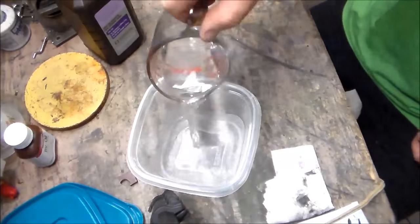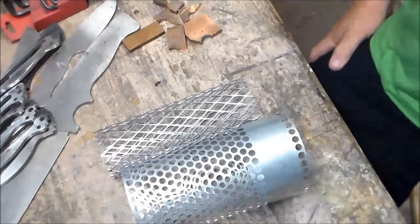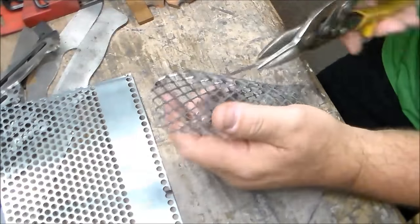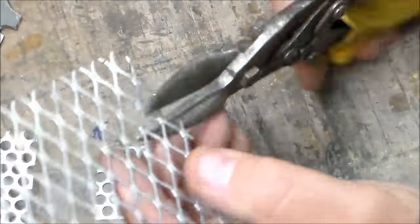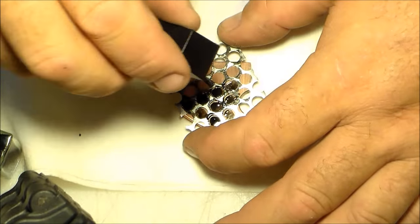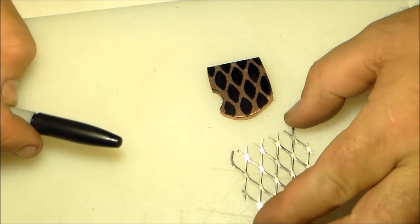Same as before — 2 parts peroxide to 1 part muriatic acid. I got to looking around my shop trying to find something to make an interesting mask or stencil, and I noticed an old air filter. If you take the paper element out of an old filter, a lot of them have some interesting metal screens inside. I grabbed another copper knife bolster and tried the fingernail polish on one side and the Sharpie on the other. Although the Sharpie doesn't mask as well, it lets a little of the acid eat through the thin spots, so it creates a neat texture — just a different effect.